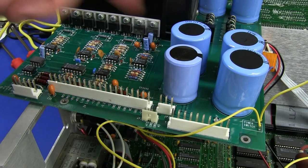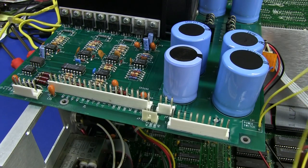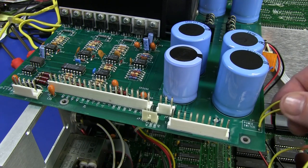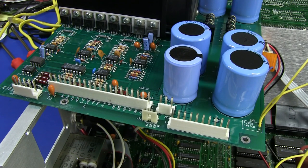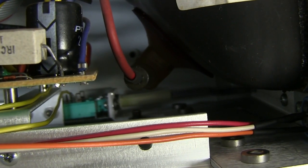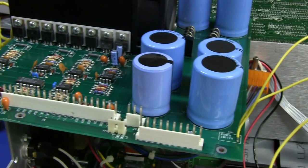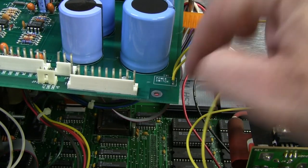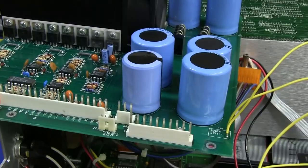I love all the big old-school power Molex connectors on here. They have beautiful modular wiring for everything with connectors. But the power switch is hardwired onto the board — what the? As if the power switch would be an afterthought. That's rather deceptive — you can see that big clunking power switch down on the front panel. You would naturally assume, given the date and Stanford Research old school style, that they'd just be switching the mains, but they're not. That switch is going up to this pokey little soft power switch connector — this is actually a soft power supply. Can't believe it.